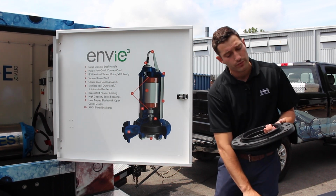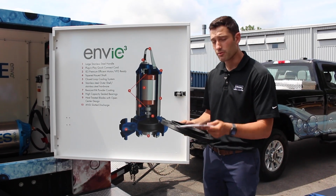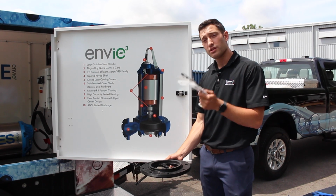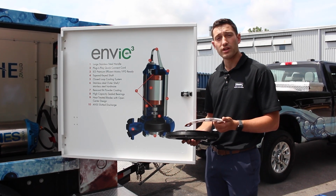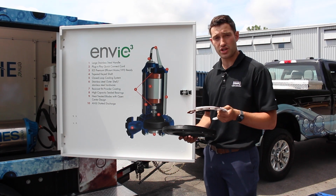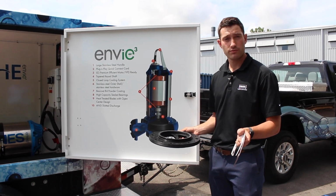All that you have to do is drop off your striker plate, and it'll come pre-shimmed with a stack of plastic shims mirrored on each side. Once you drop off that striker plate, all you have to do is addition and subtraction. Remove the number of shims that you need to get yourself back into that tolerance. And we have a color-coded key that shows you the different tolerances for each of the shims. Put your new combination in, bolt it back up, and you're good to go.